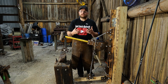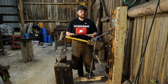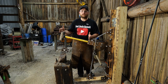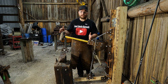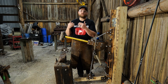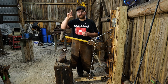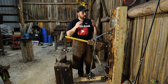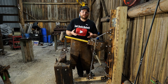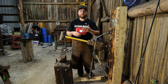Why is this important to understand? The length of this spring will be critical for the performance and the whip of this hammer. Think of it as a hybrid hammer between an air power hammer - which would be all air cylinder, air powered up and air powered down - and a spring hammer like a helve hammer, where you have a spring and you get a whip to it.